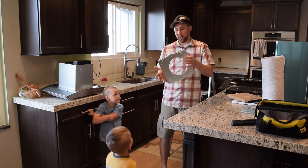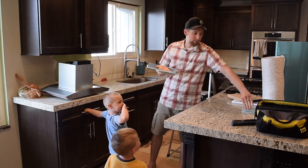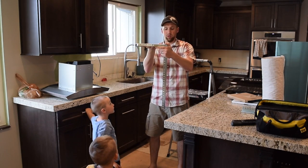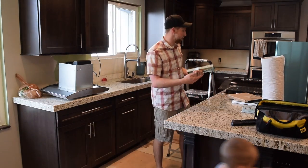This is the main bracket that holds the body of the range hood. I'm going to mount this to the ceiling and the legs come down off of it, just like this. That's what creates the structure that holds everything strong. So first step: mounting this guy up there.